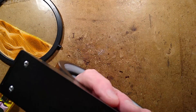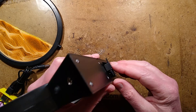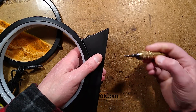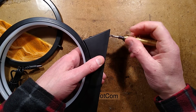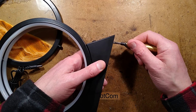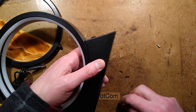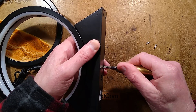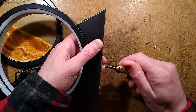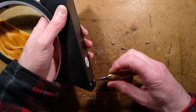So let's take a look at how this is done - I shall open it up. There may just be a wire off the circuit board or something. It takes two double-A batteries. I wonder if there's a boost circuit for the LEDs because three volts isn't really much to drive standard LED tape - it's kind of close to the edge of operation; you wouldn't get much lifespan out of the batteries, or it would go quite dim quite quickly. There appear to be six screws in the bottom, though there might be an extra screw under the battery cover - they sometimes tuck one away.